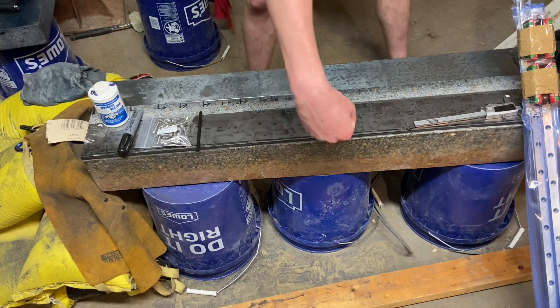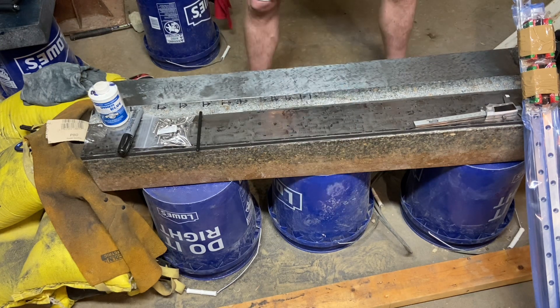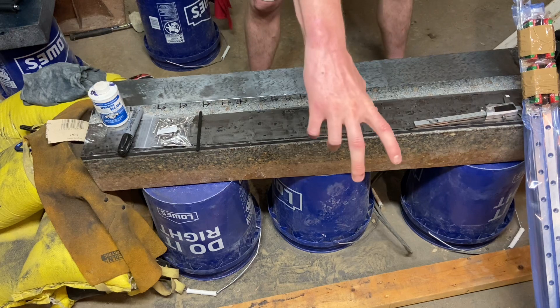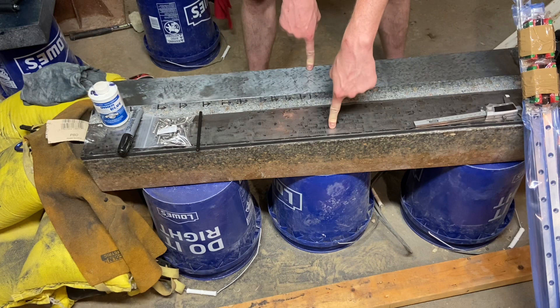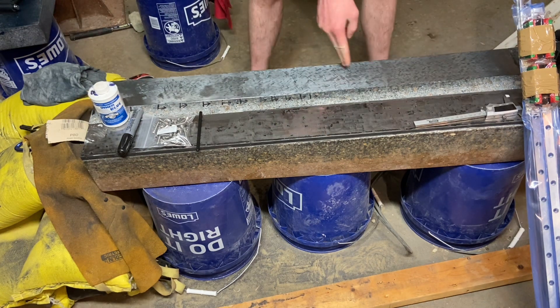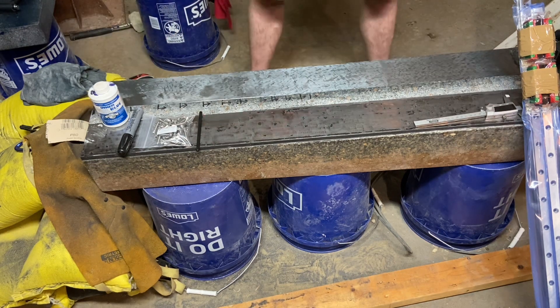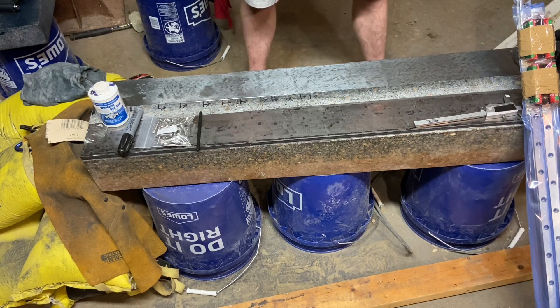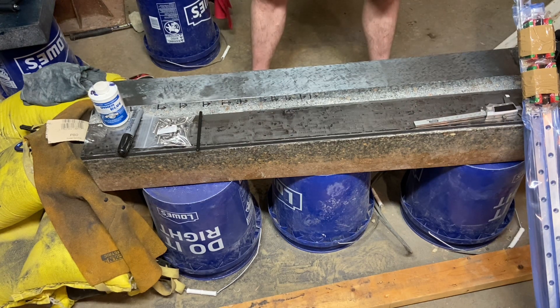It also helps because my stepper motor is going to be on the further back side, so that'll help so it's not sticking quite so far out. I'm definitely concerned about getting all the holes — something like 20 holes — all lined up so all the bolts actually fit. I especially want a little bit of play so I can make sure these are perfectly straight using my straight edge, as close as I can possibly get them.